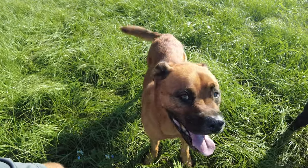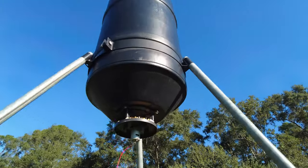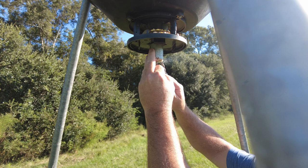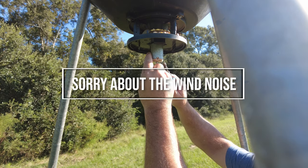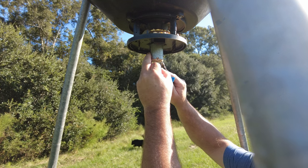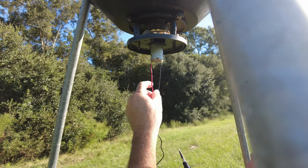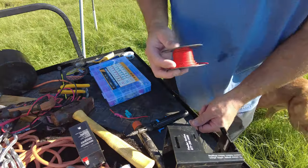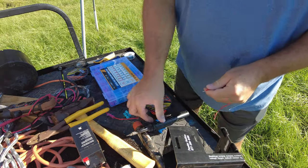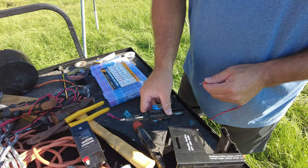You had to chase the drone, huh? Good exercise for you. This is what we've got to get fixed today. I'm gonna tin this connector a little bit — gotta be careful because these wires that go into the motor itself are very thin, and this is held with plastic. Just enough to make it so it's not a cold solder joint. I went ahead and brought some new wire down. Actually, let's fire this thing back up.